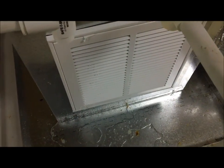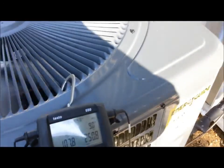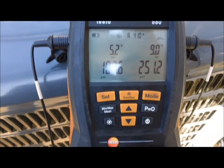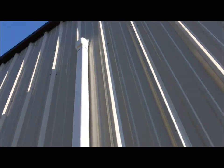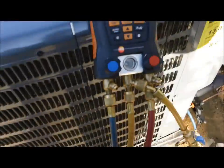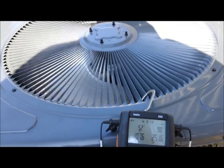I've got to redo all this crap. Let me tell you something, I am not happy right now. Alright, the system's up and running — nice, quiet 13-SEER Goodman heat pump. Going to get to target superheat here in just a minute. There's the line set and whip, and the speedy channel goes all the way up there. Drain comes down. Finally got the drain right — a lot happier about that. Target superheat is 16.6 and we're at 10.6, jumping up to 11. That's within five, and it's playing around a little bit, so we're in the ballpark.